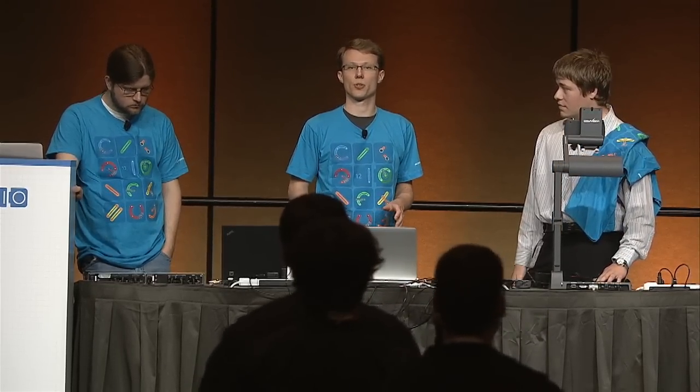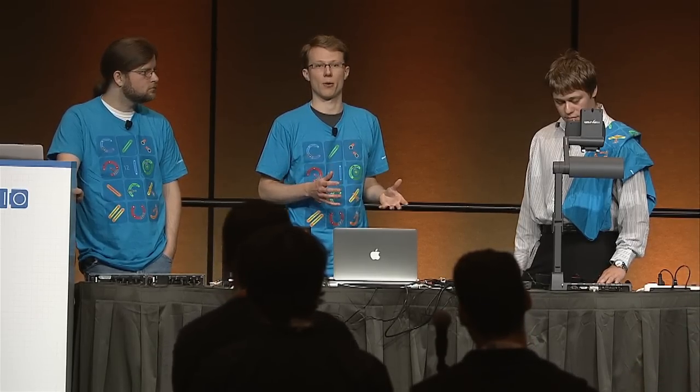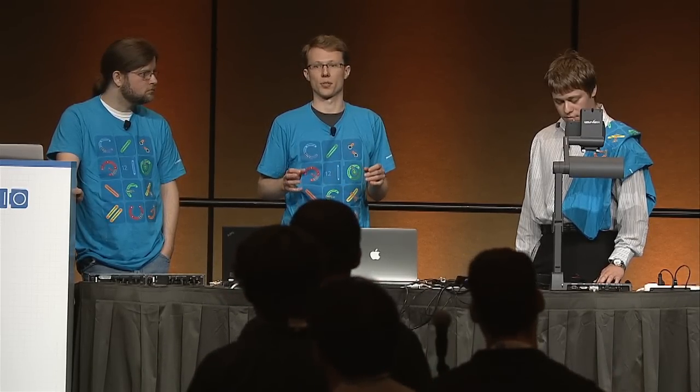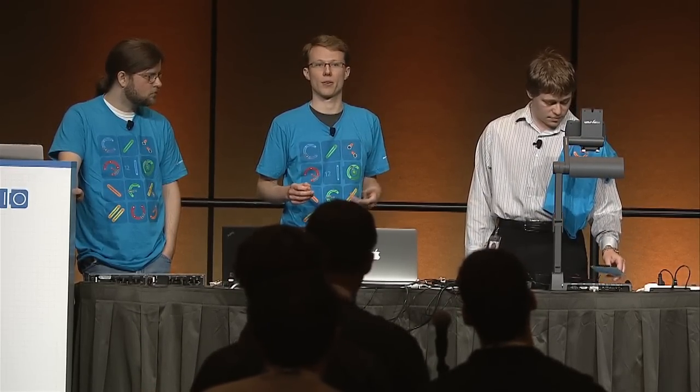Sure, I'll take this question, Travis. It's a known issue with the way that USB accessories work. Essentially the phone becomes a peripheral and the accessory becomes the host. Because of that relationship, the way USB works, the accessory then has to provide power to the host, which is a little strange. The reason has to do with the lack of adoption of USB On-The-Go, which I think is rather unfortunate, but it's the world that we live in and we have to deal with it.